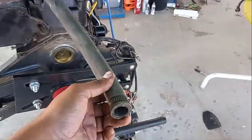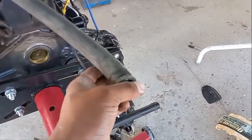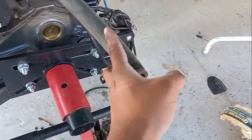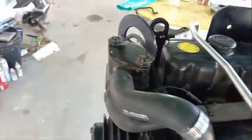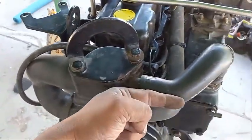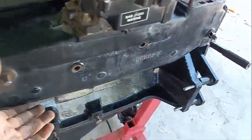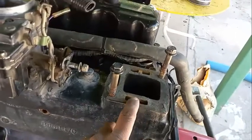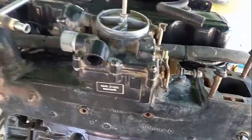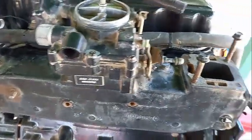Once the engine is hot, it actually needs cold water, so it grabs the cool water from here — which we removed but I put back in just so you can see it. Typically what you see online is people put a garden hose right here, so cold water is flowing into the engine. There's a limit to how much water can go inside, so it has to exit. Cold water goes in, hot water comes out — hot water travels here, goes inside the exhaust manifold, and comes up. This engine is cast iron, and since there's no antifreeze, that's fine.